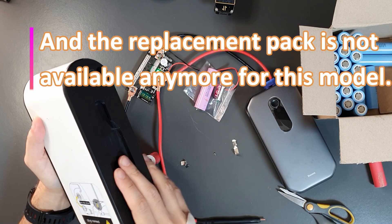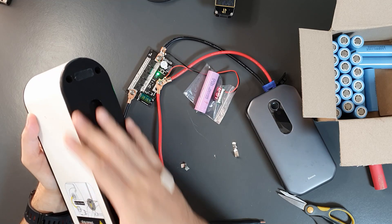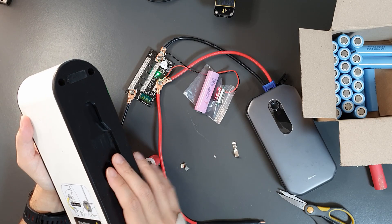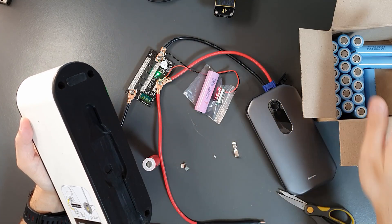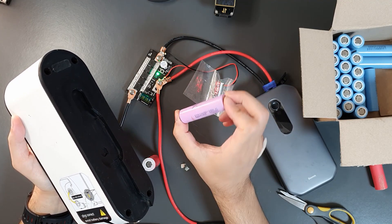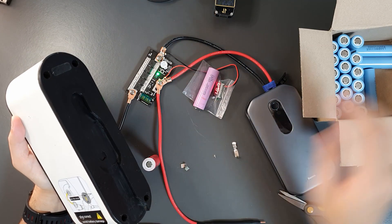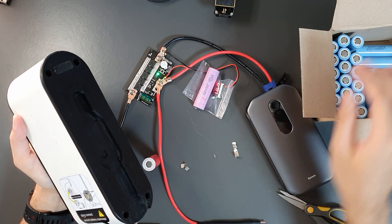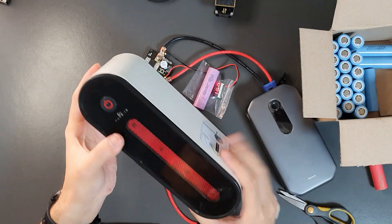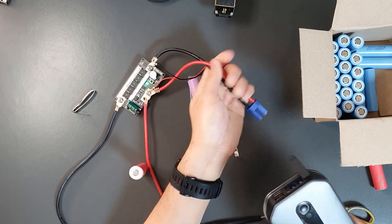My e-bike battery has stopped working again even after replacing some cells, so I've decided to replace all 20 cells. It's a 10S2P pack with Samsung 26H cells — 5200mAh at 36 volts. I'll be replacing them with these LG cells, giving 6400mAh at 36 volts. I'll show that rebuild in one of my next videos. You can easily unplug this from the jump starter and still use it to charge your phone or restart your car.